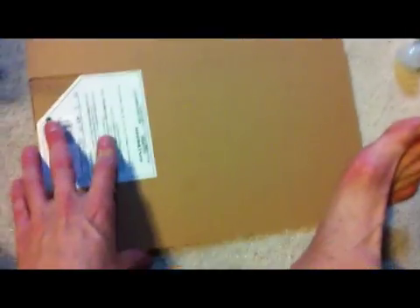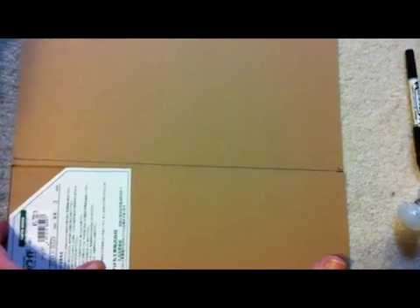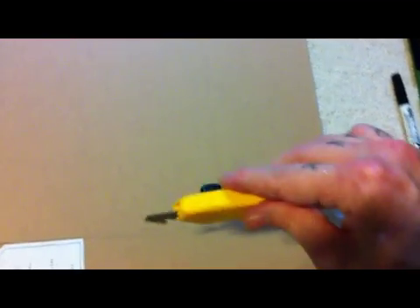To guide the knife I use an older piece of plexiglass, and I use a special knife for plexiglass — you can find it in art stores, just ask for a special knife for plexiglass and it cuts really easily. It's great for cutting three millimeter plexiglass. You make a few passes — you don't cut it all the way through, you go four, five, six times until you can see it cuts halfway through the thickness, and then all you have to do is bend it and it will break really easily.